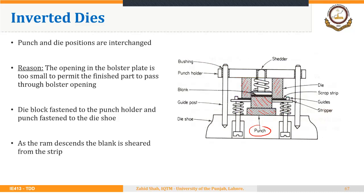The rest of the elements are the same — we have guide bushings and guide pins — but the die is attached to the punch holder and the punch is attached to the die holder. This type of die is also very common in deep drawing or cup drawing operations where the part being drawn is large. So the punch and die orientation is reversed.